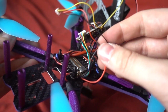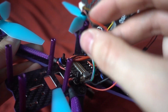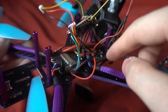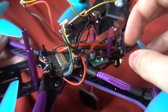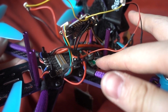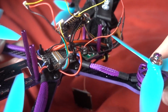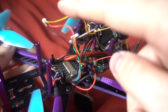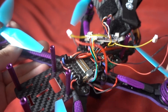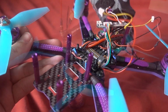Okay, so I've tapped into the 5V of the ESC there, going to the RunCam Split, and then the video stays the same. I've also hooked up the ground to the regulator as well, so I put a regulator in this to get rid of some of the noise. I will put a link in the description to that video. So now all that is left to do is connect this up to the RunCam Split, put all this back together, and we should have a 1080p 60 recorder and FPV at the same time.